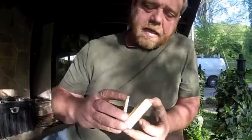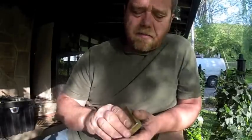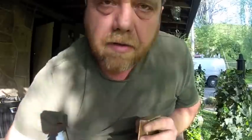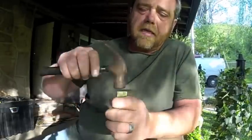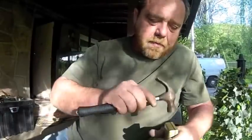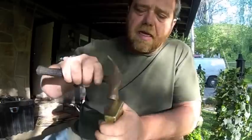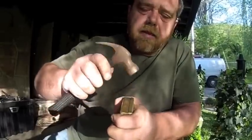I kind of wanted to show you just a little bit what I found out about working this brass. Unlike some other stuff, whenever you lay it on the table or in the vise or something you can pound it straighter. Well, this brass metal is so soft that — and you can see, once it's together — I haven't decided if I'm going to solder or braze these corners. I may not even do anything. I may just continue doing what I'm doing. But once you've got it shaped and these are bent, you just kind of hold it. Brass is pliable, and the more I just work on this lid around through here, the more it shapes.